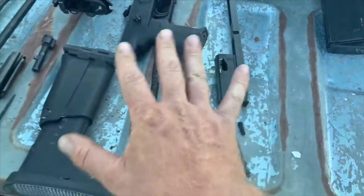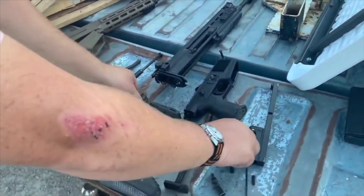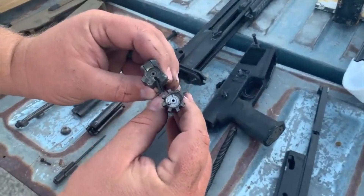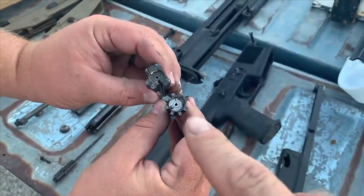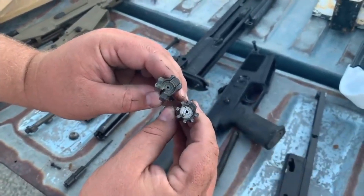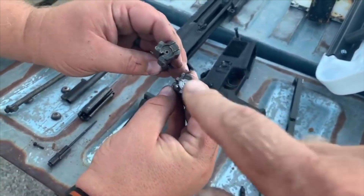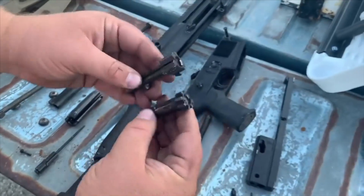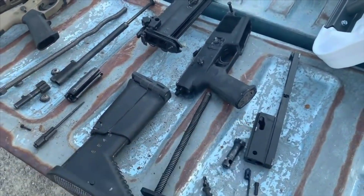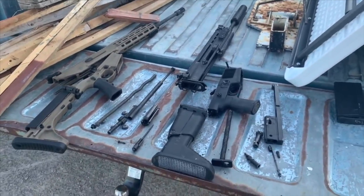You can see that these guns are very similar in their intended goals and purposes, although they approach them from different perspectives. Here's a comparison of the XCR bolt versus the SCAR bolt. The SCAR is more Stoner-influenced, while the XCR is more AK-influenced, with three locking lugs and a very large extractor. There are no gas rings on the SCAR bolt of course, because it is a short-stroke gas system, but the similarities are pretty much there.